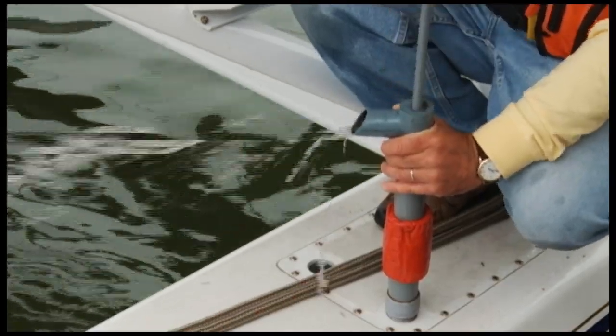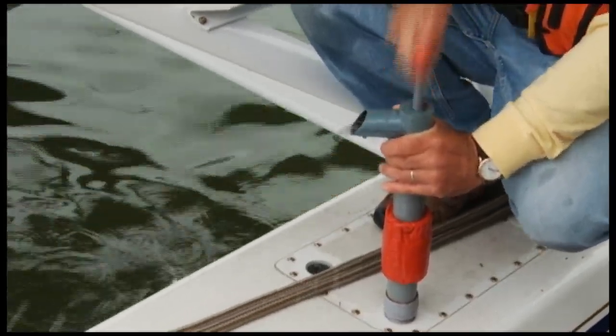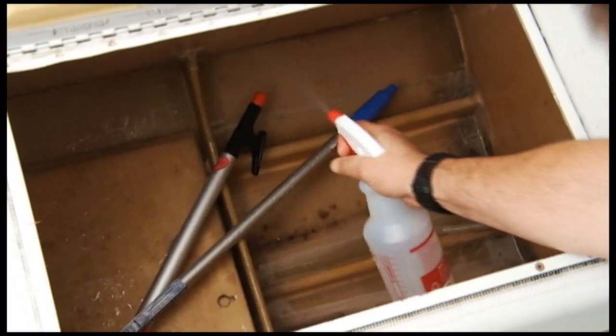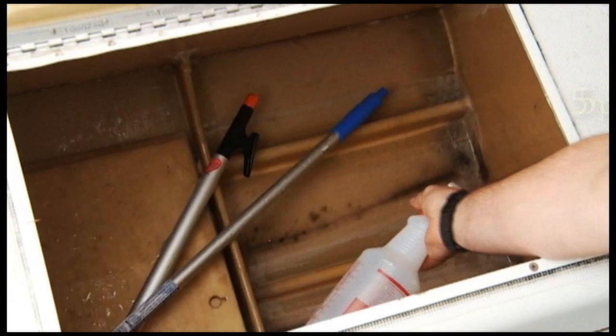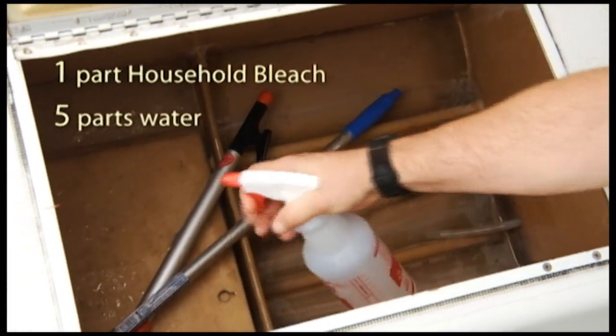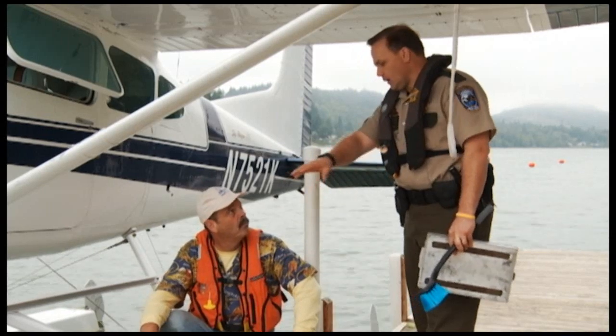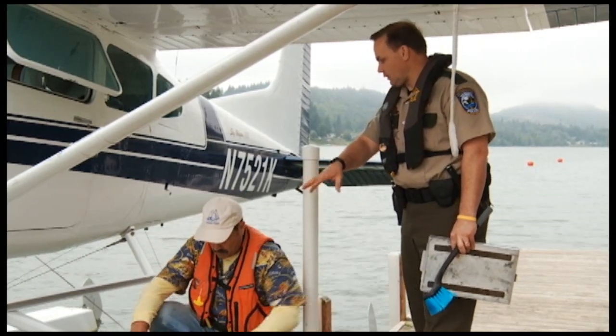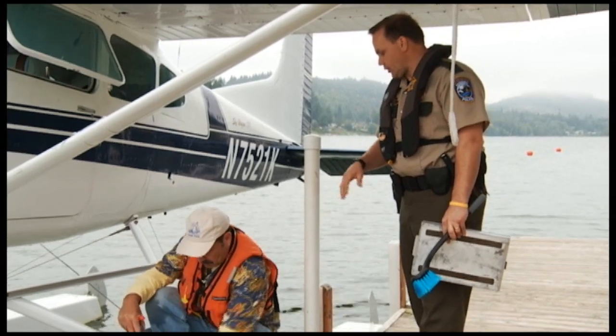So just like in your pre-flight, make sure that all the holds are pumped completely dry. And then if there's still any little bit of standing water in there, if possible, you can take a solution of bleach water — and spray it around in there, making sure that you're not getting it out into the lake water — and that'll kill any possible larvae that's hidden with a little bit of moisture or water in that area.